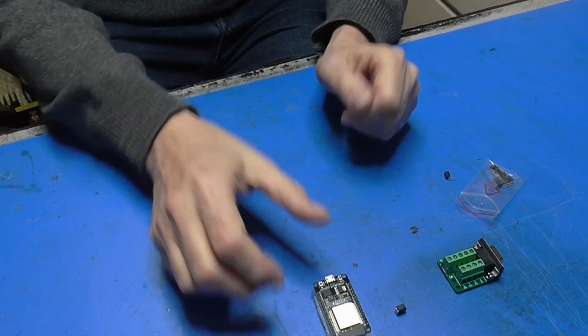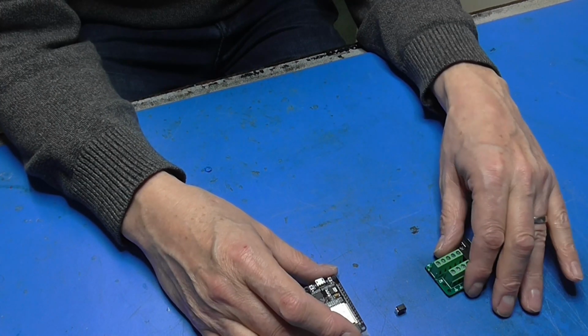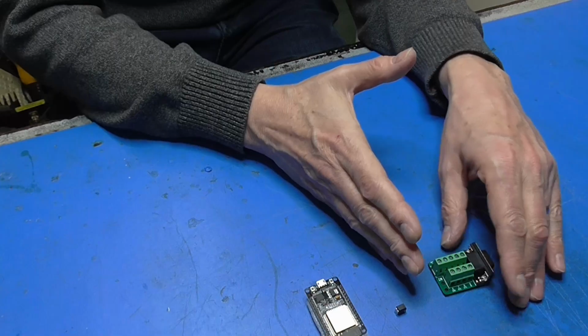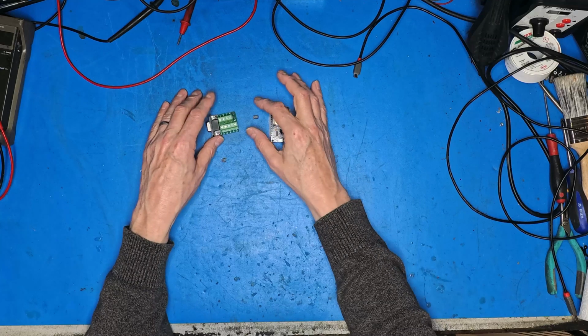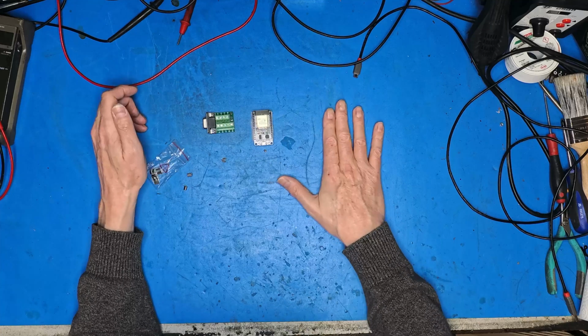So there is no electrical connection between our ESP32 and our joystick port. Now, that, one, provides a safe environment for our ESP to operate, and two, provides a safe environment so we don't damage the CIA and the 64. CIAs are becoming a little bit hard to find and a little bit expensive, so best we don't blow them up, eh? So that offers us a nice level of protection and an easy way to switch our joystick port. So that's what we're going to use there.